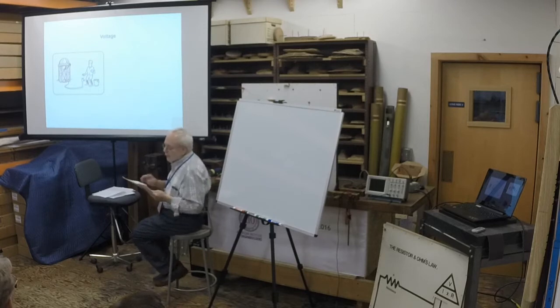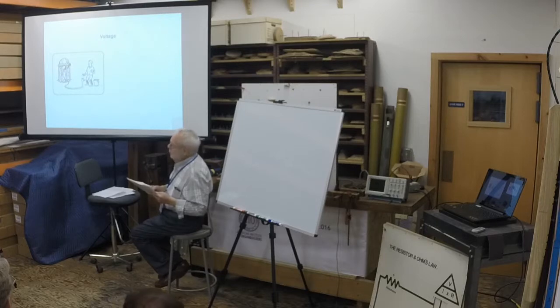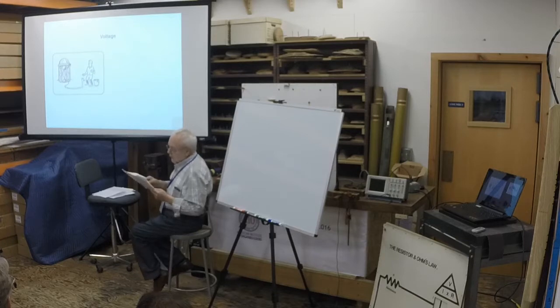Voltage is the driving force in a circuit. It's sometimes easier to think about it as pressure in a water system. In a perfectly designed system, the pressure at any point is always the same regardless of the situation. We know this is not always achieved, but the same principles apply to electricity. Pressure is always highest when there is no flow. The guy standing here has a perfectly stable pressure situation. The faucet is off, and the pressure is the same everywhere in the pipe. In fact, the pressure is determined by the height of the water in the tower.